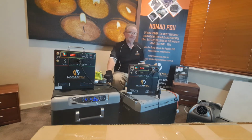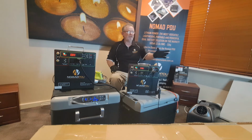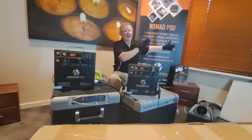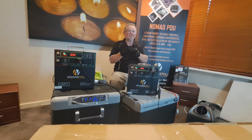We also have another 50 litre fridge that likes 9 volt. It works perfectly down to 9 volt. The Nomad runs from 12.6 down to 9 volt. The new prismatics, they'll actually fully charge and they'll run at around 12.8 constant. So it's about the chemistry and the different voltage. It's up to you as a customer to look at what it is you require.